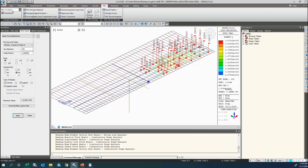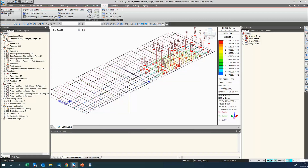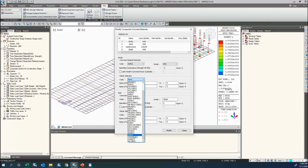I need to define the PSC design material. Till now I had assigned the material for my girders, but now I also need to provide all reinforcement material. I provide Fe 500 for the slab part and M30 for the slab concrete. I can select the entire girder to design, or specify a particular element — for example, Element 252. I click apply and then generate a detailed Excel report for that element. I can also provide serviceability load combinations, which can be done through the software's auto-generation feature — selecting concrete bridge, selecting loads, and setting limit state design for both static loads and construction stage loads.